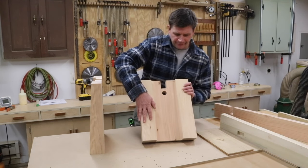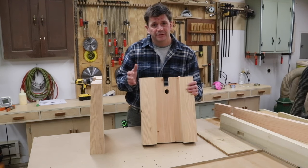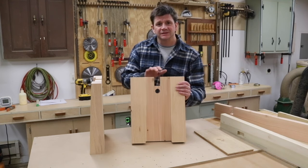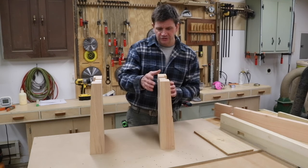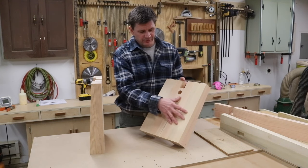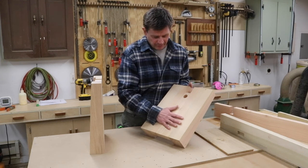You've got a 4x4 on each side. The 4x4s are milled down to 3.25 by 3.25 inches and then tapered. Then you've got a centerpiece made with a 2x8 that's milled down to six and a quarter inches. The three parts are joined together — I use the biscuit joiner because it just makes it easier and keeps the boards nice and flush.